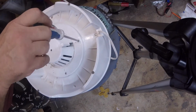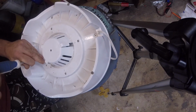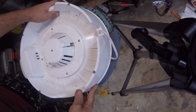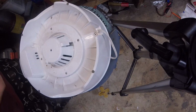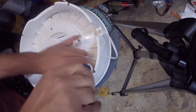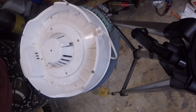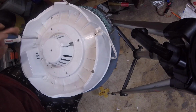Basically I had a lot of filament sitting around all summer in the shop. I do have it climate controlled, but it falls behind. It's just a little mini split. Tried to print with some filament that I had laying around, some gold, and it definitely was not behaving. So it dawned on me that it was full of humidity and that I needed to do something, and then I was sure I threw this thing away. And then I was like, well, let me check one more spot, and there it was.